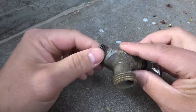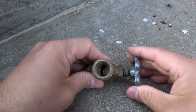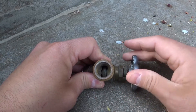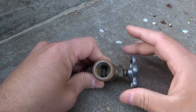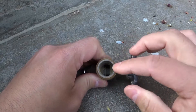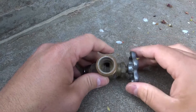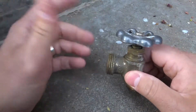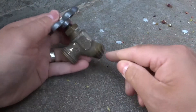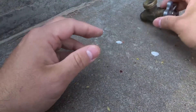The water goes into here, then passes through and goes out to the hose. When I twist this clockwise you can see the gap starting to close. When I can't twist it anymore — when it's fully twisted — the gap is closed and the water will not pass through. Now, when you have a water shutoff or a hose bib that leaks, there can be many things that go wrong: it can leak from different points, or water can continue to pass through. Now you have a good idea of what can potentially be the cause.